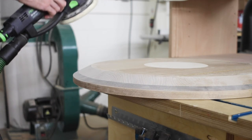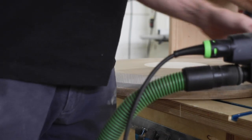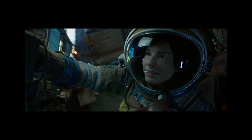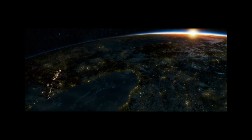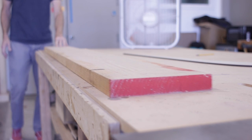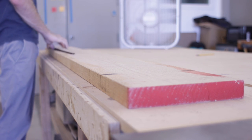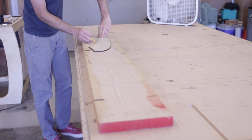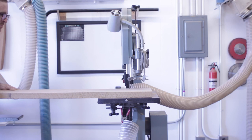So with the tabletop pretty much done, it was time to pack everything up and head back up to my shop to work on the base and get everything finished. To make the base, I of course started with a template, which I traced out so that I could break down my board into rough cut parts that would then allow me to mill each part separately using my six inch wide jointer.